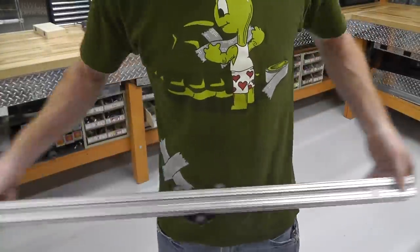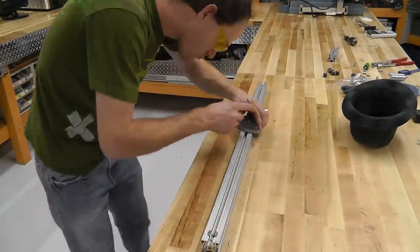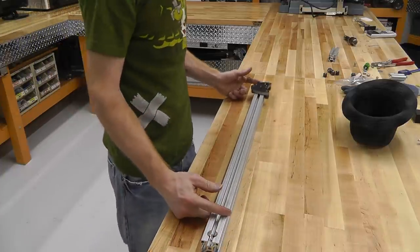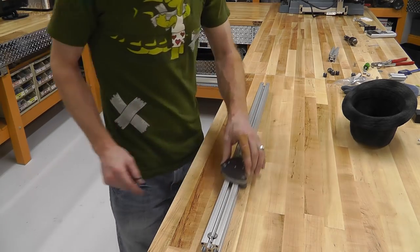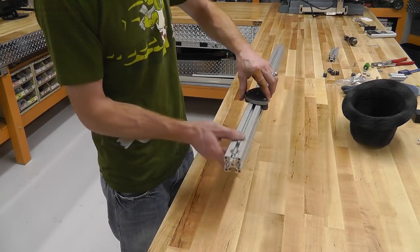So if you listen really closely, you can hear this little tick tick tick tick in this footage, and that's actually due to the bearing — the one I pressed in there funny. Remember I told you last time you'll ruin the bearings? Listen to it very closely. That is actually what that little tick noise is. Luckily I have one spare, so no big concern here.